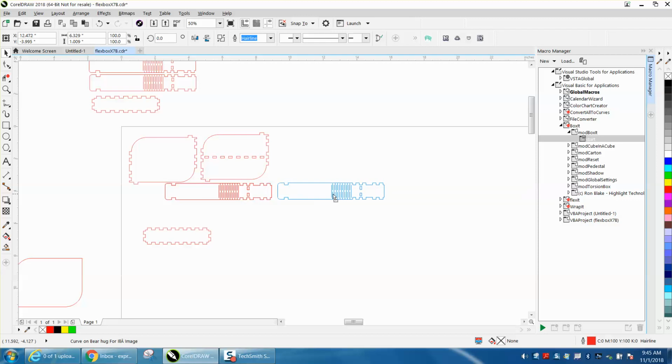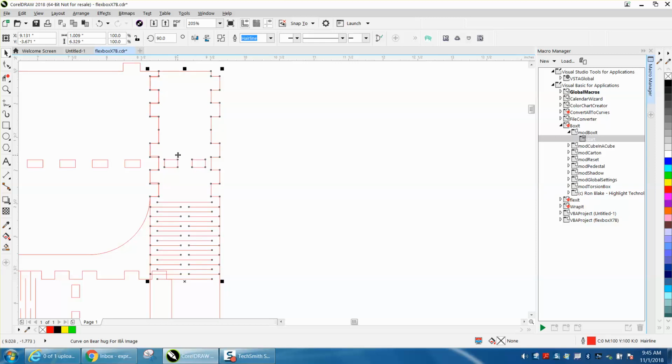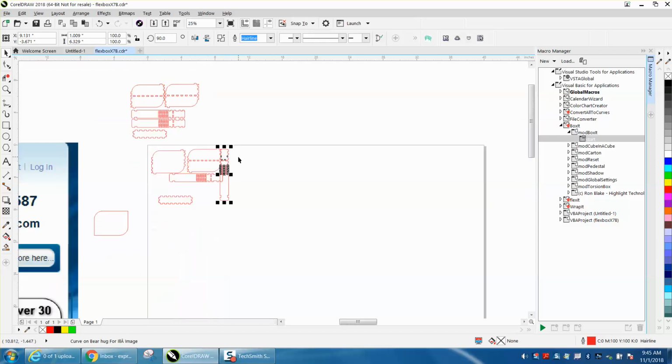And then just for reassurance, what I would do is turn this to a 90-degree angle, and I would match it up with this to make sure you did put your tabs in the right position. You can always grab it if you have snap to object. I'm not perfect and our curve's a little bit off, but you can see my tabs are on that plane. Let's change it back to 0. Put it here. You need 2 of these. We've got 2 of them.